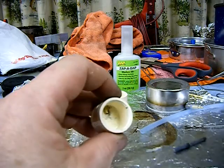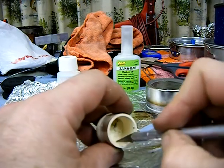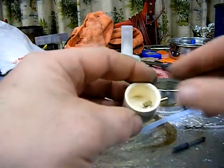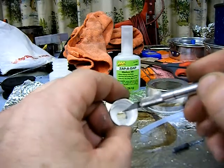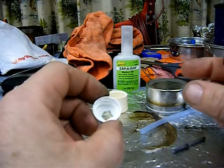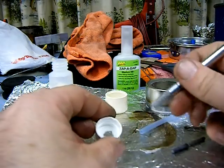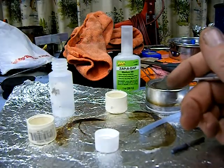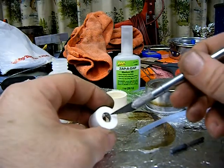You don't need too much — just enough for air to get past the lid once it's pressed in. Once I was satisfied, I took my exacto knife and scraped the excess plastic that built up. Then I carefully popped out the little seal inside the cap. If you have a sharp object about three-eighths inch diameter, put it on a hard surface like a piece of wood, center it, and tap it to cut a nice circle in the middle of that seal — some bullet casings might have the right diameter.